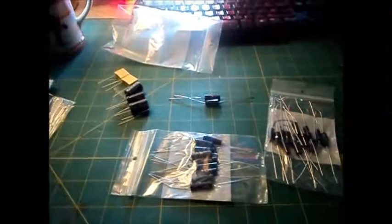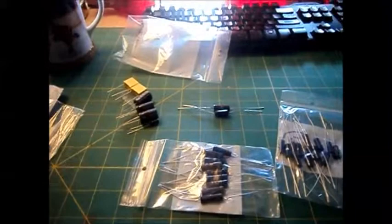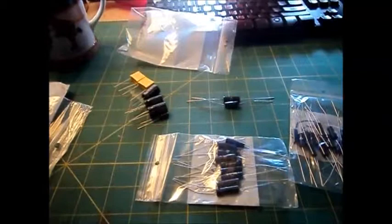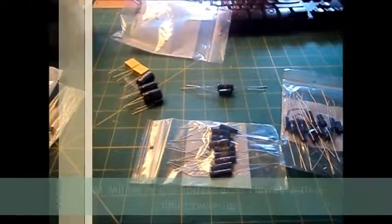I do have to buy some tubes — about four of them. And instead of buying a replacement rectifier glass tube, I'm going to buy a copper solid-state one. I've read things online that it will keep your transformer cooler on this particular radio, keep the whole radio cooler, and keep it more stable once it's warmed up — less drift. I'll put all that in an upcoming video.